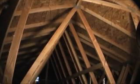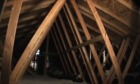So in the attic, we're going to be taking a look at the framing, the ventilation, and the insulation system. We'll be taking a look at the framing to see if there's any kind of broken frame or damage to any kind of the wood. We'll be looking at the sheathing beneath the roof, looking for any kind of water damage or any kind of possible change of the framing structure.